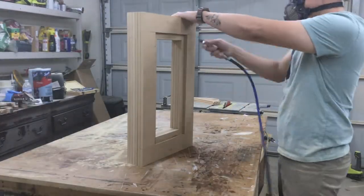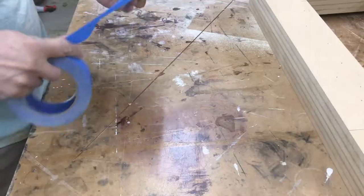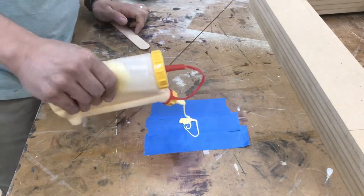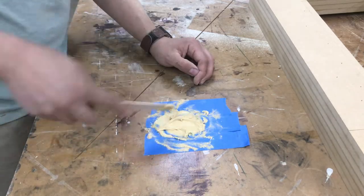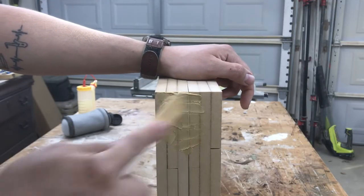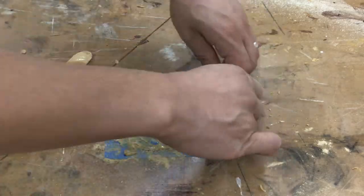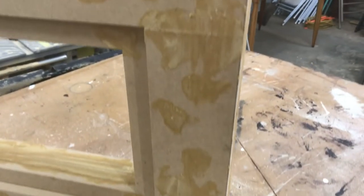For the next step, I blew away all the dust and fixed the issue of the pieces not being cut to the proper length. I used the tape trick as a mixing tray for some wood glue and MDF sawdust mixed together to make a paste to fill in all the holes and gaps. I applied it to the wood and let it dry before sanding it smooth. Cleanup was easy by just removing the tape and tossing it out. I could have easily used regular wood filler but I ran out, so I opted for this method instead.